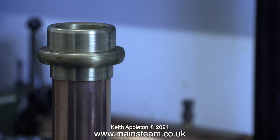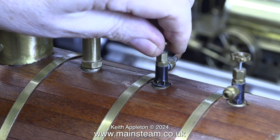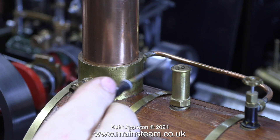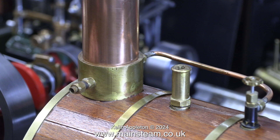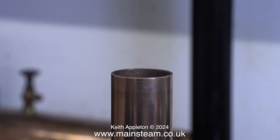Something has to be done about this chimney cap — it's made from brass, it's very thick, it's loose, and it's very heavy. I intend to remachine this piece of brass so it looks more like the chimney cap on my Sterling Single. A quick look at the taps on top of the boiler: the one on the right really has no function — I'd like to replace it with a whistle valve and a whistle. The valve in the middle is the main steam outlet valve to the steam plant. It connects to a piece of pipe that goes into the chimney, loops down into the hot part of the flue, and then comes out the other side where it connects to the engine. I've removed the very ugly, very heavy top cap — I'll machine it later on in the job.